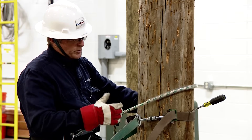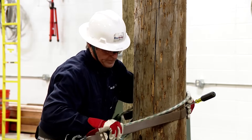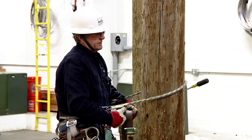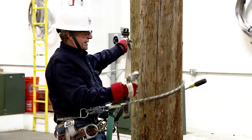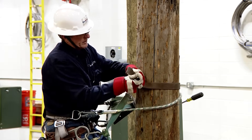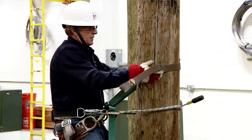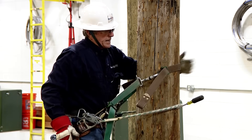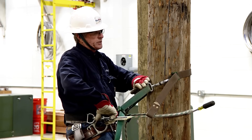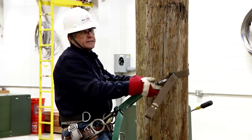To relieve the buck squeeze during a transition, stand up, relieve tension by pushing the cam grab forward, take it loose, pass it around to yourself, bring it up through your secondary safety. Step up if needed, pass it back around, connect it back together, and readjust. For total control, put your hand behind the pole on the buck squeeze. Once above the obstruction with buck squeeze back, stand up, take your secondary loose, stow it, and climb up.